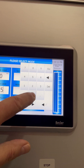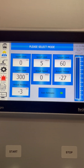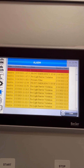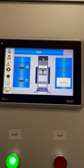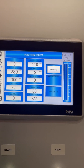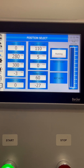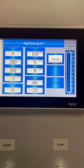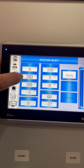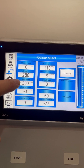You can change your stroke. The maximum stroke on this press is 300mm. It's easy to enter the parameters. In automatic mode, each program has these settings that can be programmed. The actual position is showing at minus three, which can be calibrated and will correct itself as the hydraulics warm up. The upper limit is where it returns to. The slowdown position is where it goes into working mode. 300 is the ultimate stroke position — so it starts at zero, goes to 280, advances to 300, then returns back to zero.